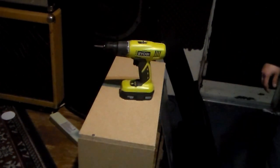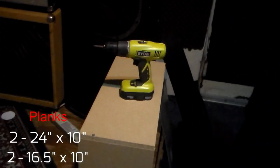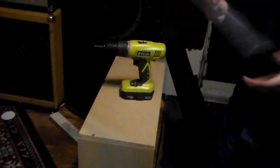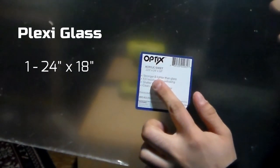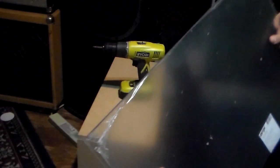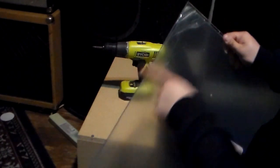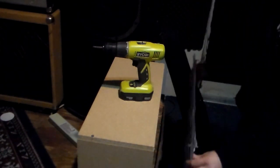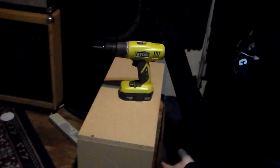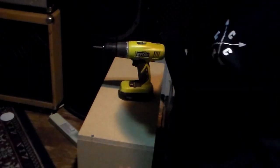I already got started with the box — I'll put up some measurements so you can see them. You're really going by the plexiglass. They come in pre-cut 24-inch by 18-inch sheets at about a quarter-inch thickness. When you buy your wood for your ego light-up box, you want the long side to be 24 inches, but cut the inside a little bit shorter — I have 16 and a half inches so it fits on top nicely. If you make the inside 18 inches it's going to be too wide, so keep that in mind.